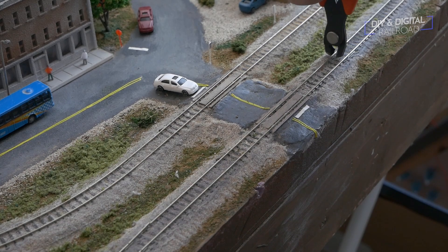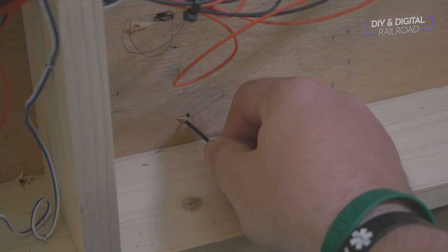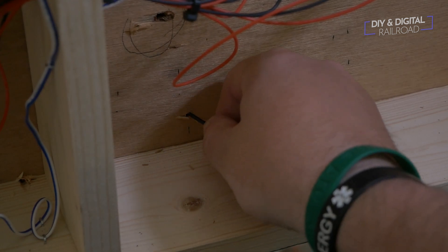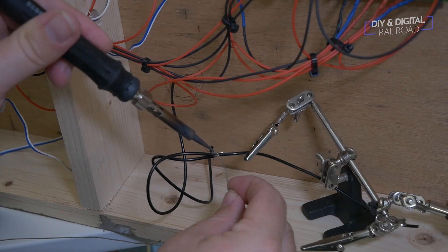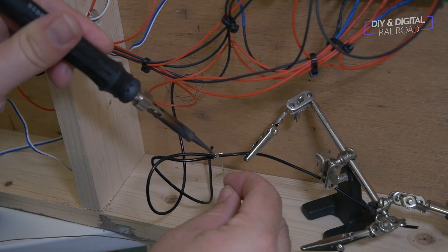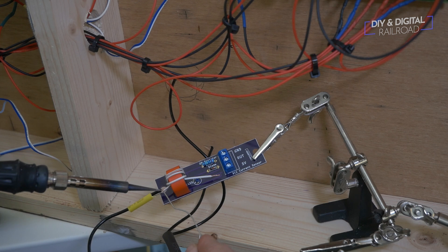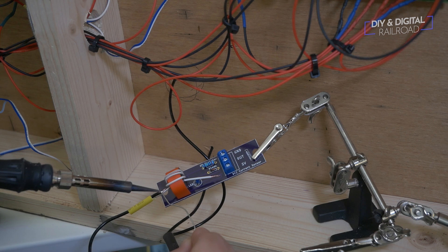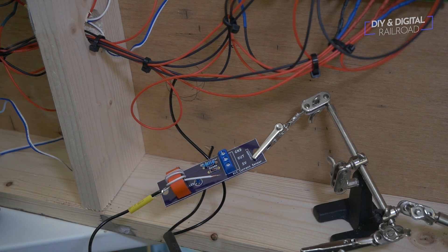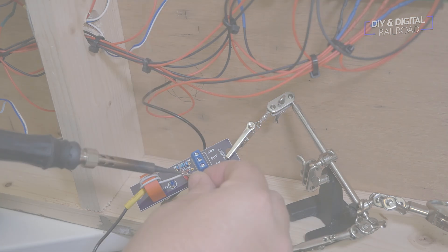I got the rail cutters as part of their model railroading soldering kit, and I have a link to that in the description below. The soldering kit is totally customizable so that you can get whatever you need for model railroading. Now it's time to run wire. I run a 20-gauge solid wire to the track, then combine them into a single feeder and run them through the current sensor. I ended up using a 22-gauge wire soldered to the feeder so that it would fit around the tiny opening of the current sensor, and I ended up looping it three times. I soldered everything in place and covered the connections with heat shrink.